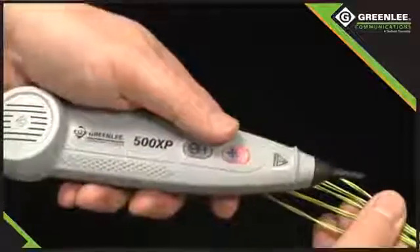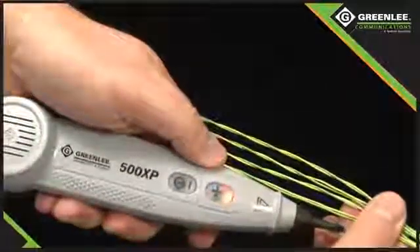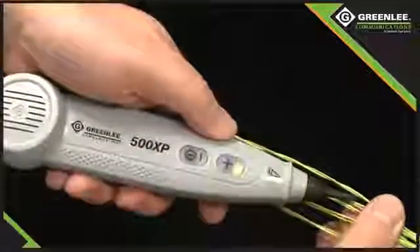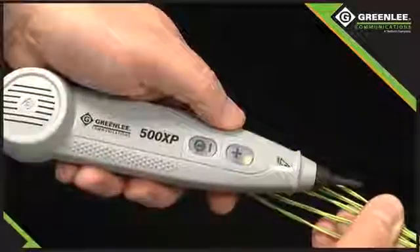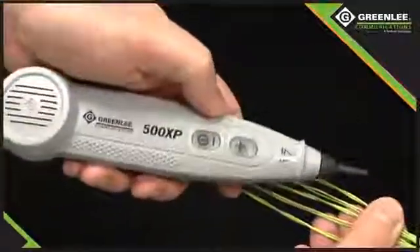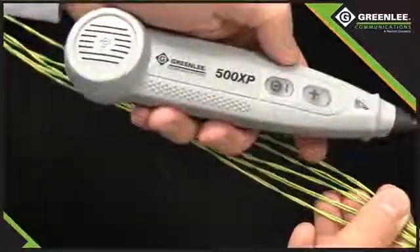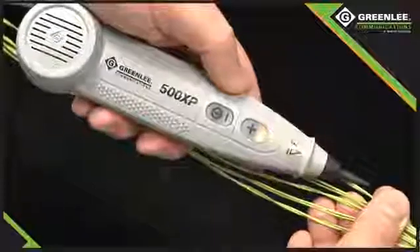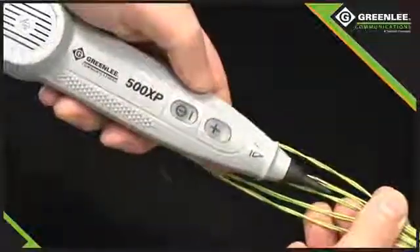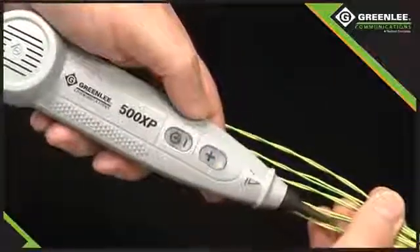We can eliminate the power influence hum by going to mode 2. The warning still works and we still pick up the noisy lines and the tones are there. But we can clearly discriminate those tracing tones with the third mode, adding filters that enable the LEDs to respond directly to the tracing tones, while eliminating the noise but still responding to the power hum.